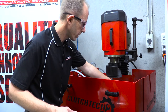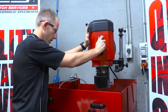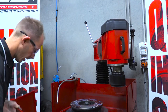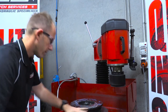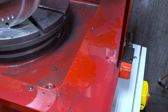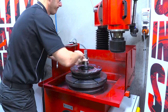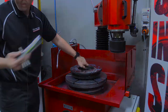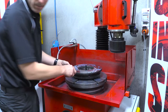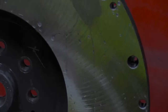That'll just keep your machine in really good condition. Once the grind is completed, move the head right out of the way to preserve your wheel and make sure you can't get any damage on it. Take the guard off. As you can see the machine has been cleaned — it's not too bad. We're just going to get that flywheel off itself, so just unlock it. Now we have the grind completed.